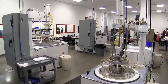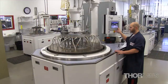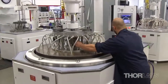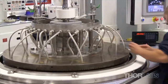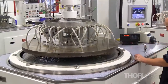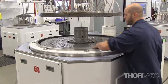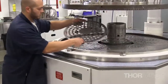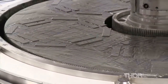For large volume fabrication, Thorlabs also has SpeedFam machines, which grind or polish both sides of an optic simultaneously. Thorlabs uses two different sizes: two smaller SpeedFam 9B machines can hold up to 140 1-inch diameter round optics or 32 2-inch square optics in a single run, while two larger SpeedFam 16B machines can grind or polish up to 325 1-inch diameter round optics or 80 2-inch square optics in a single run. In the two polishing machines, optics are sandwiched between two polyurethane polishing pads, and a cerium oxide polishing compound is pumped into the system through tubing connected to holes in each pad's inner surface.